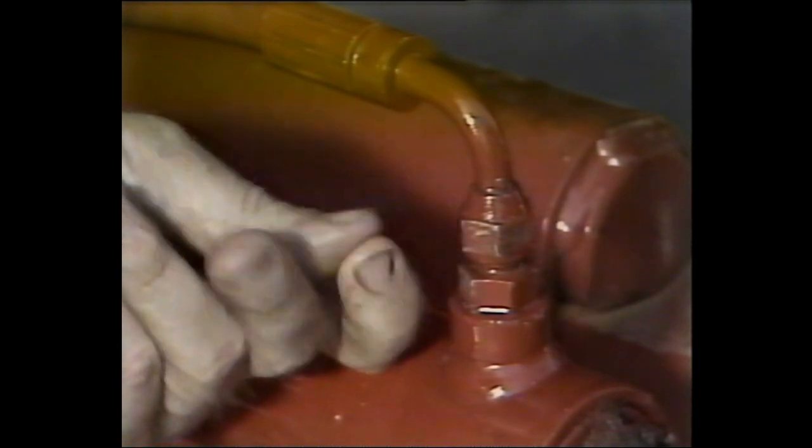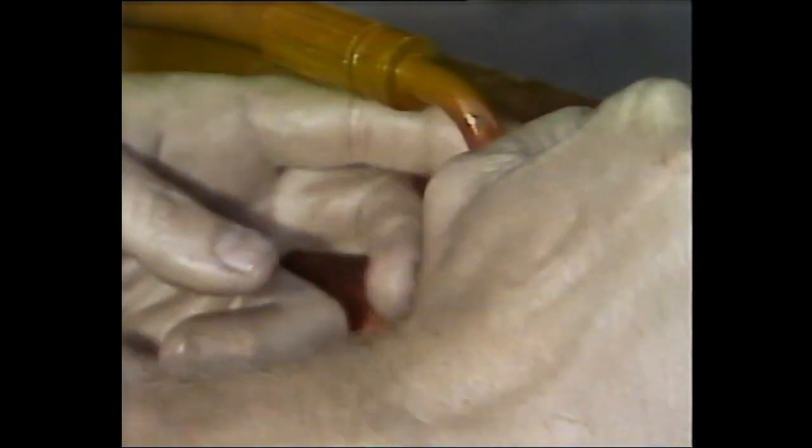This concludes our pressure checks, but you still need to look for leaks, seeps, and weeps around all hydraulic fittings. Also, if you notice that any of the hydraulic control levers fail to return to neutral, inspect and adjust their linkage accordingly.